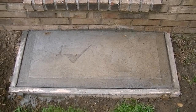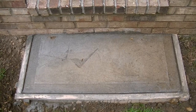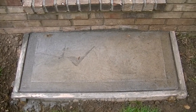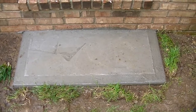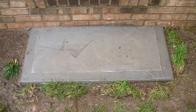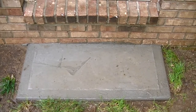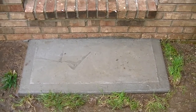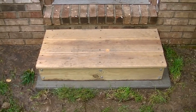It's been a couple days since I got it done — been a couple rainy days — but it is done. There are a couple little marks on it where I dropped something, and it came out with a rough texture, but that's just how it turned out. I went ahead and pulled the boards off, put the dirt around it, watered it down, and put the step back on. I did put a little bit of pitch downward so it runs the water away from the building. Looks like a spider is already taking up homestead on the slab! That's the finished product — my objective was to pour a concrete slab to set my wooden step on, and I'm all set.